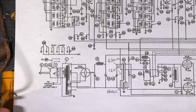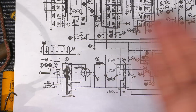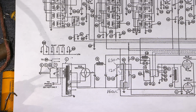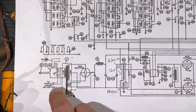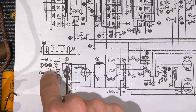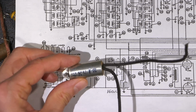Okay, a lot of new designs, they don't do that. They have the fuse in other places and things like that. You can even see there's a different version of the Stromberg-Carlson that has a phono adapter, and it's kind of a skyscraper-y looking radio. It's a pretty sought after, very rare unit as well. And you can see that they've got the phonograph after the fuse and the switch as well. So everything is protected by that first fuse in line. That's very important in a good design.